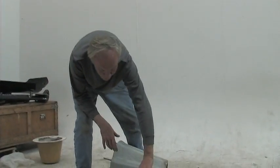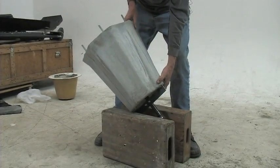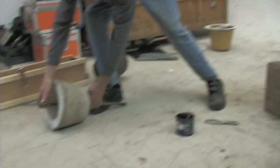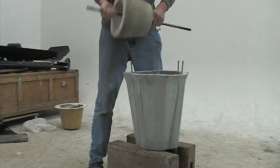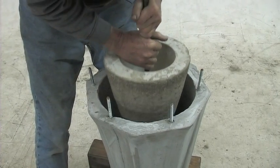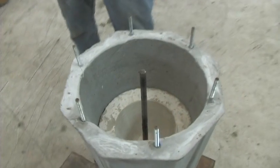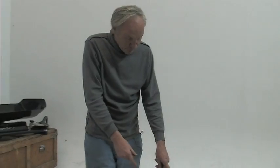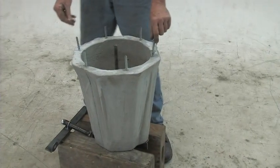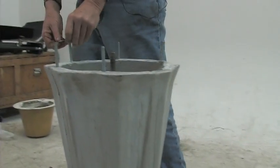In most villages you'll have a couple of concrete blocks, so they'll get a couple of big pieces of wood to do this. Set it with the tube facing straight down. Find yesterday's rotor and drop it in — it's now dried a bit, you can see the rough surface. Drop it in until it goes all the way in and it's perfectly centered. You've got six studs sticking up. Find the ones that go straight down to the other side that hold the bracket on — they're the strongest ones. Put a nut and a washer down on both of them as far as they'll easily go.